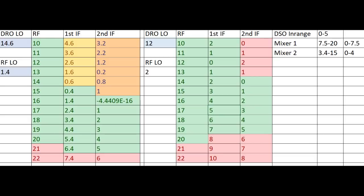So the limitation of this is, again, whatever the mixer's IF frequency. In this case, that 20 gigahertz mixer from Mini-Circuits, again, it's rated for 20 gigahertz on the RF, and it has an IF maximum frequency of 7 gigahertz. So that 19 gigahertz is essentially the upper limit. So what I was thinking is, basically, we're going to gain 2 gigahertz by adding a whole another mixer. It's probably not worth it just for this demonstration.